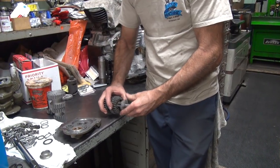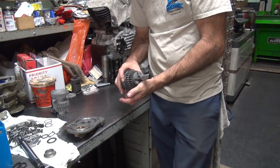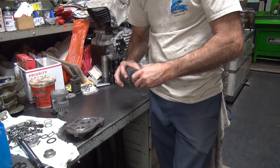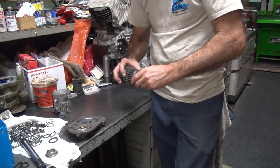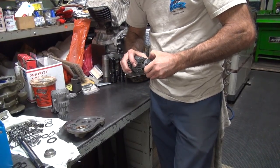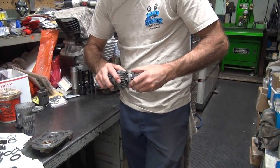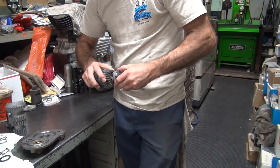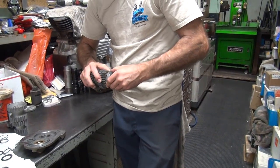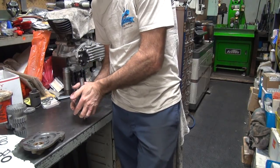that's a little... We got some issues with that. That might not shift freely. Yeah, that's a little tight on the shaft. We'll have to use a little lapping compound on that one. I'm burnishing it in though, see? So you're working it in? Mm-hmm. That's dry. Now if I had lapping compound on there, it would bring it in a little better.